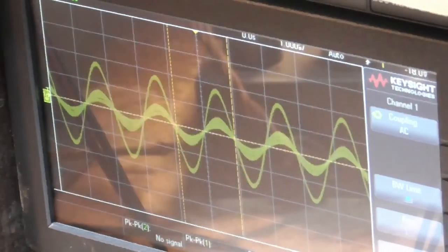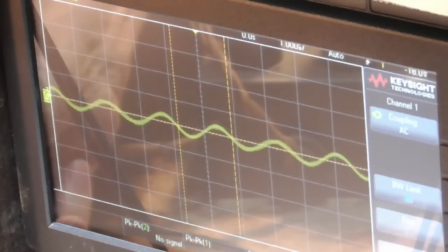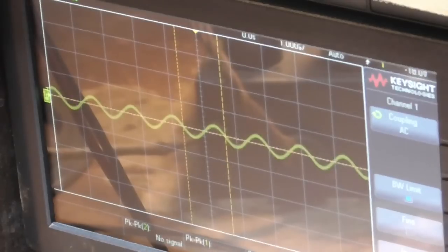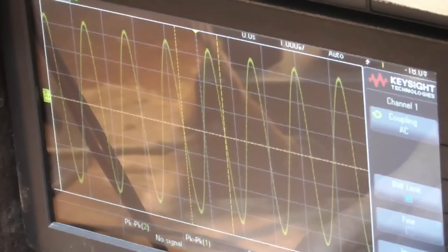523. We're actually getting a signal. Now we're putting a half a volt into the input, so it's ridiculous. But at least we are converting and we're getting a signal through the thing. At 550 kilohertz, we should get about 900 and something. Right at 1 megahertz, roughly, for the oscillator. Right now it's reading 759, so the oscillator is way low.